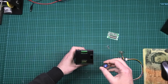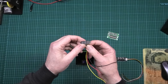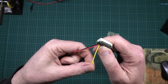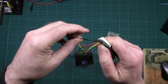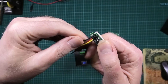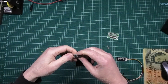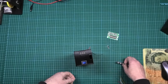The next thing is your power switch — it's up to you which way you put it, mine's going like that — and the battery indicator, the voltage indicator. With these voltage indicators you've got to be careful: there's a positive, a negative, and a sense wire. The sense can be linked to the positive — it doesn't really matter — but check the wiring carefully. There was a strand of wire actually touching the positive on mine.